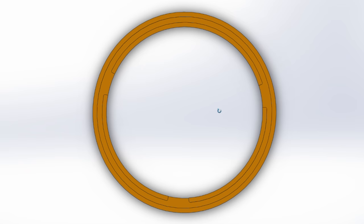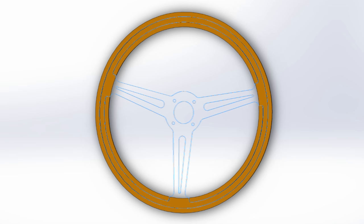Now we need to make the groove on the inside where the aluminum will go. To do this I needed another template — two templates actually, bolted together — using another edge cutting bit with a bearing. The bottom part of the template sits inside the maple; the top part allows us to cut the groove right in the middle of the donut. It also has pockets for the three aluminum spokes. I set the depth to half of the aluminum thickness and went around the edge. All of these templates were made by my friends over at Send Cut Send — they also made the aluminum center. If you're looking for fast, accurate, low-cost laser and router parts, check them out. With the channel cut out, it's time for a test fit. Oh yeah, nice and snug. Perfect.